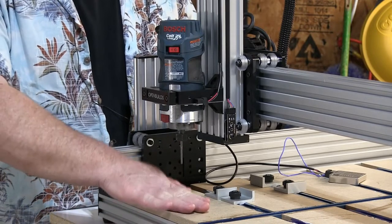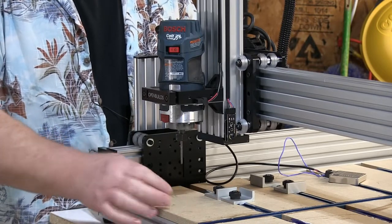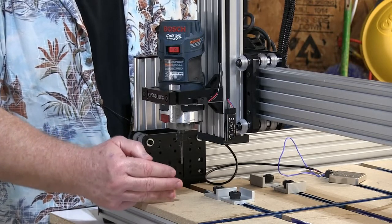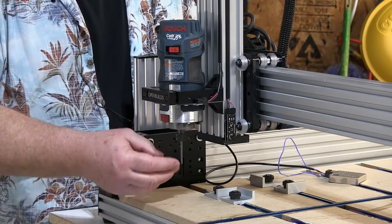The way we're going to use this, we're going to use tooling boards that mount to this board. So this is not actually a spoiler board. This is actually a tool board. By doing that, I've eaten up 12 millimeters of my space that the bit can't go into. And I also wanted a little bit more room between my bit and the clamps so that I didn't have any head crashes when the bit ran into it.